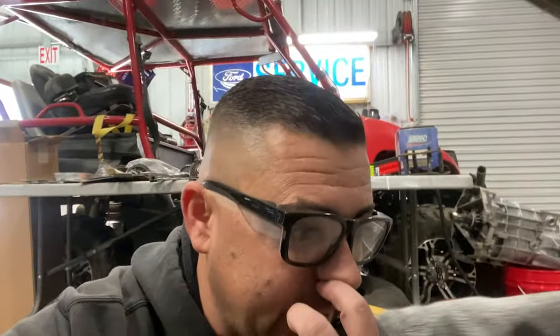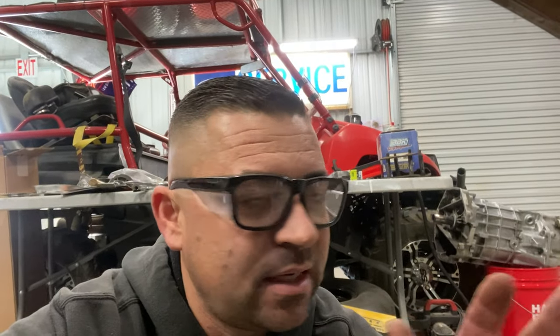And Jacob Fox, or J Fox, on Instagram, I'll drop a link, or I'll drop his Instagram name. I've asked him a million questions, and then 63 Turbo Falcon, he's building one of these. It's LS swapped. I picked both of their brains. Both had to do the exact same thing to be able to get the type of tire that you need to get in here. I can actually get the wheel and tire in here, but it's touching everything. It's touching the fender well on the outside of the car and then on the inside. So that's just what I got to do to be able to get the tire in here that I want. And then once I get all this stuff cut out, gusseted, and put back together, then I guess we can get the wheels kind of sat in here, and then I can figure out how wide the rear end needs to be.